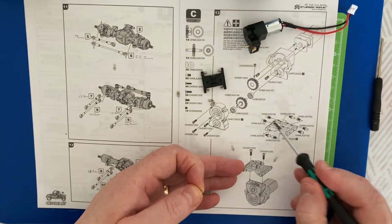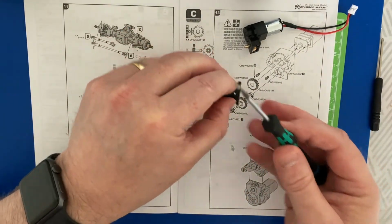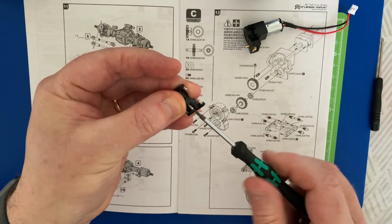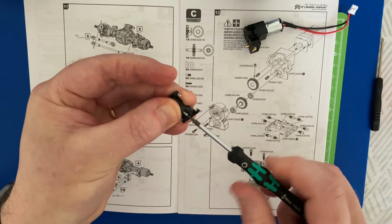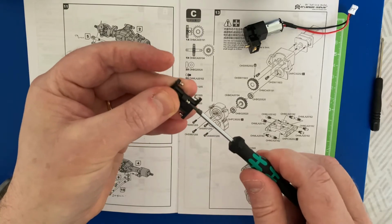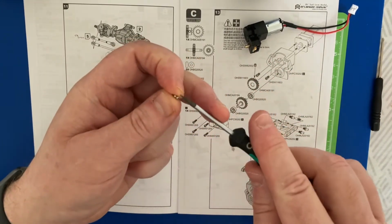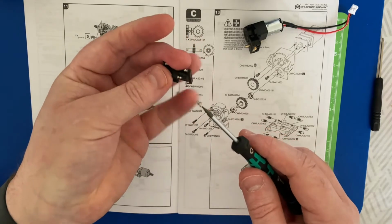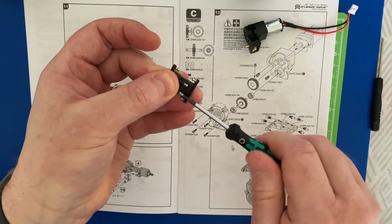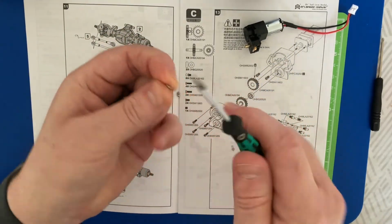as per the drawing, so either side of the top. So again, pop in the little ball joint into the hole on the side, and I just sort of back off a quarter of a turn and then feed it through, and there we go. And all I do is I'll just come back a couple of bits as I go, just so the threads can make. There we go, and that's nipped. Same again. So cutting your own threads in effect into the little plastic. So yeah, there we are. So again, wind that in, come back a couple, wind that in, and that's normally enough to help the thread.